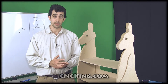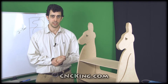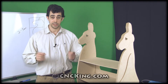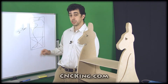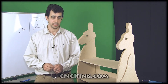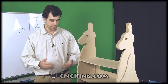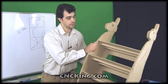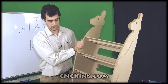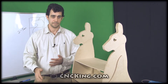The problem is the fine particulate. Even with an extraction system, you end up with all this little particulate flying in the air. After cutting this project — which is the equivalent of 21 sheets — I had a headache for three days. It's just not fun material to work with. I built my model to support even a very weak wood by making cross members across the board so that it's plenty strong. But yeah, MDF just sucks. I'm not using it again.